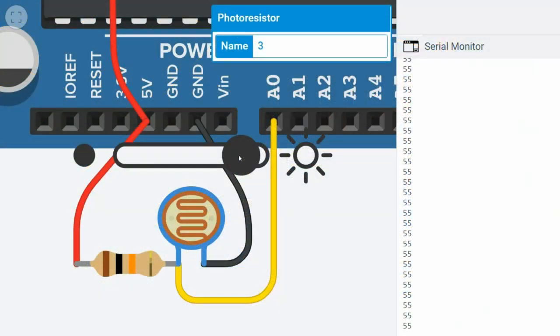The pins labeled with the A prefix are so-called analog pins, which means our microcontroller can read a range of voltages between 0 and 5 volts, with a precision of 4.9 millivolts. These voltages are displayed as integer numbers running from 0 to 1023. When using a light sensor, analog pins allow us to measure a range of lighting conditions that we might describe as very bright, sort of bright, dim, or dark. Notice the sensor values grow smaller as the conditions become brighter.